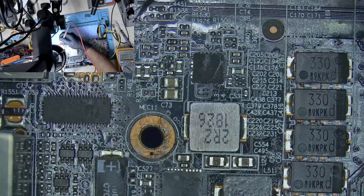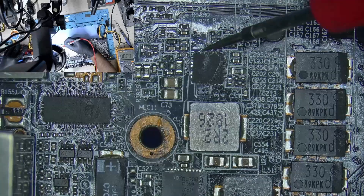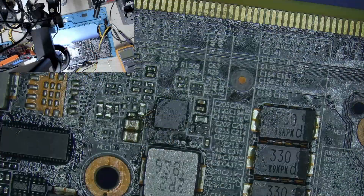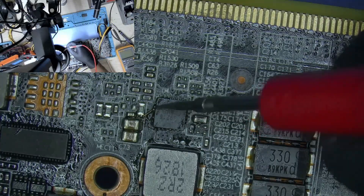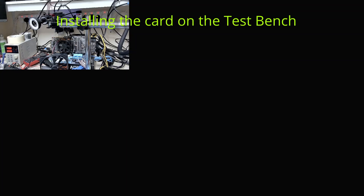All the input voltages are present, but 12 volts which is supposed to connect to the chip is still missing. So I'm going to jump a wire from that resistor to the chip. I've jumped this wire connecting the resistor and pin numbers 8 and 9, which are supposed to be 12 volts. This is the jumper wire I've connected to fix that problem. And after fixing the jumper, we have our PEX back.